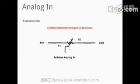If we look at the schematic symbol, then again this is the symbol of the resistor, and this middle leg is to show, okay, we have the partial resistor R1 and this partial resistor R2, and we always connect the potentiometer on the one side to the plus and the other side to the ground. Which side is not so important by now.